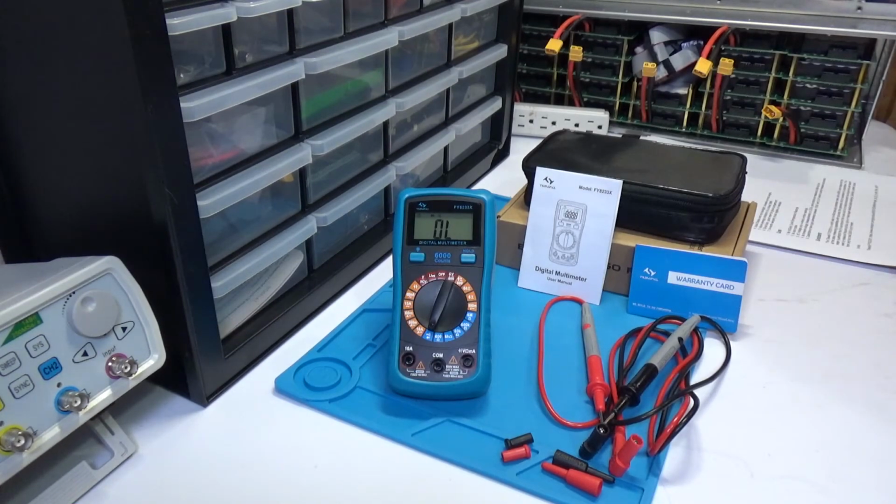There are no voltage measurements on the LEDs, and some of the diodes are measured a bit too low. In the case of the Schottky, it was about 40 counts below what it should have been. And on the germaniums, I'd guess about 25 counts. It's not terrible. You can still identify the diode. The other diodes, it did just fine. In fact, it was fairly close to the Fluke and the 2C42 on the other three types. But yeah, diodes is definitely one of the weaker links in this meter.